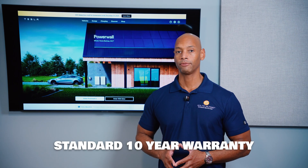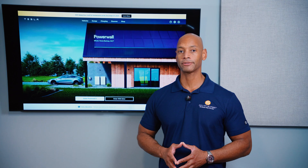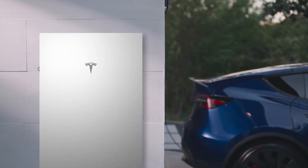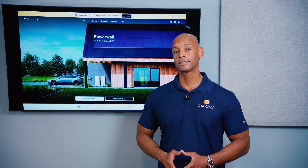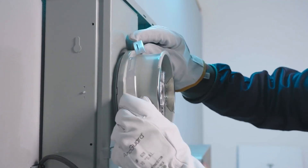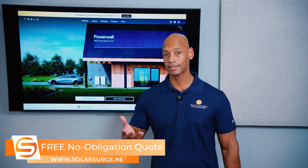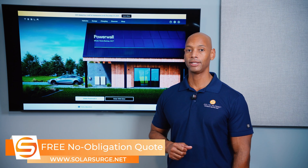Tesla offers a standard 10-year warranty, which is becoming the emerging standard for home battery systems. In terms of cost, the Tesla system is going to be on the lower end of the price spectrum. The cost of the Powerwall 3 battery-inverter itself, as well as the overall cost of an installation, is on the lower end — largely because the single device does your solar inverter and battery inverter function with no need for module-level power electronics on the roof. For ease of installation, I'm awarding the Powerwall 3 plus three points. Tesla's backup switch — their version of a meter collar adapter — allows whole house backup installation without a critical loads panel or modifying inside wiring, which dramatically reduces complexity.